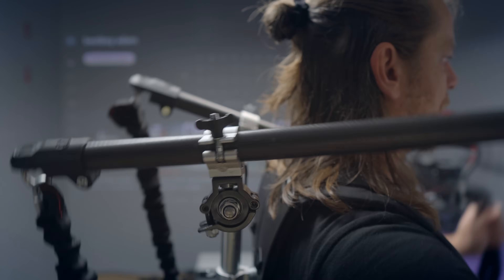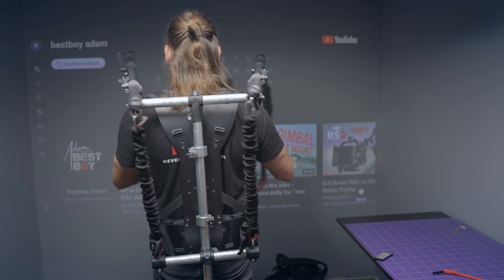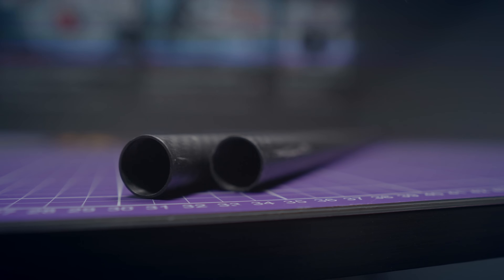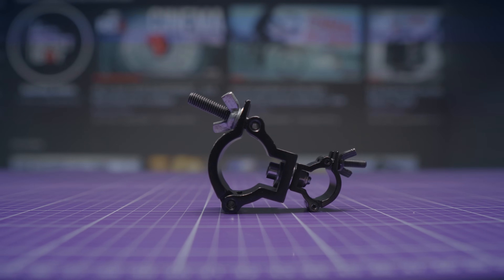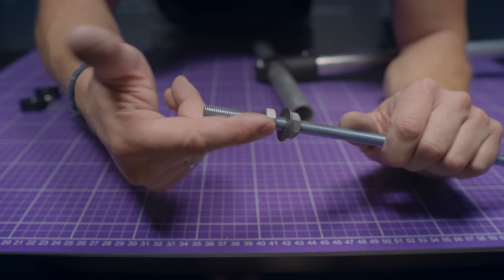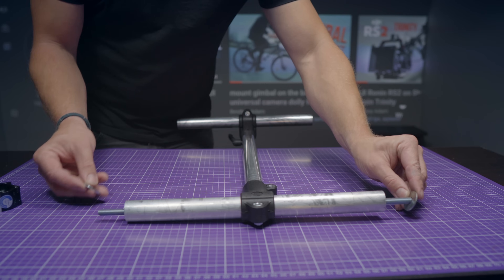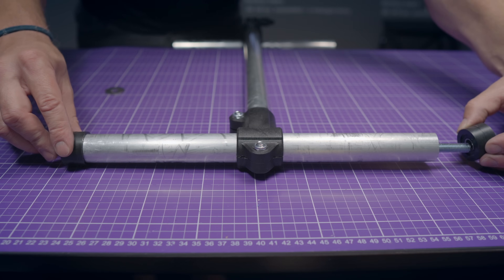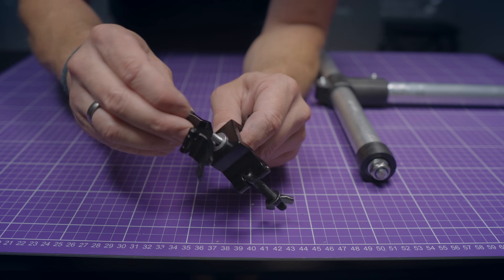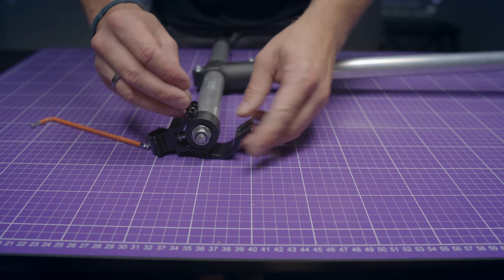Now it's time for the only and basically most complicated part: the adjustable arm mounts. We need this so that each of the arms can move in any direction individually. For this, we need two 30mm tubes, 32mm pulleys, small and large clamps, and a threaded rod a little longer than the top tube. Fix the washer on the thread to keep the distance inside the tube, insert the rod into the tube, block it with the washers, and put pulleys on each end. Block the ends with a nut — and that's it. Next, twist two clamps together, but not too tightly so they have a bit of space on the connection, then just put them on the pulley.